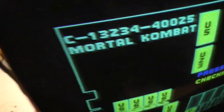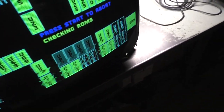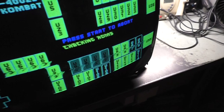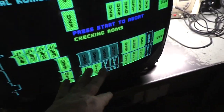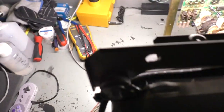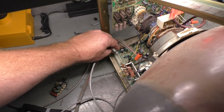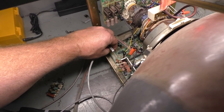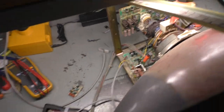We may have a problem with the U701 chip. We may have a problem with that U701, because that's what does all this. I've had that problem before. But the question is, you can clearly see this happening here. How come it doesn't happen with the TPG? The TPG is good for what it is, but you always want to use an actual PCB because we weren't having that with the test pattern generator.